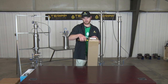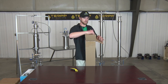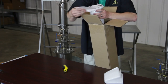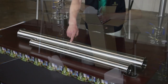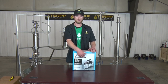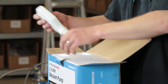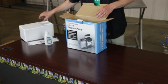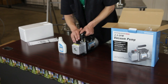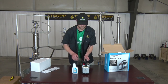We're going to cut open our two pound and five pound column box. There should be a five pound column inside the box that will also contain a two pound column stuffed inside of it, so we'll take those out. Now we'll be unboxing our high vacuum pump. This will be removing any oxygen from any closed system that we'll be introducing butane into. We'll want to make sure that we fill the vacuum pump up to the proper level so that it runs appropriately.